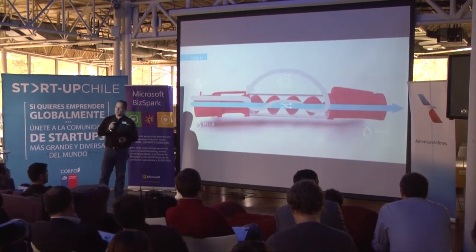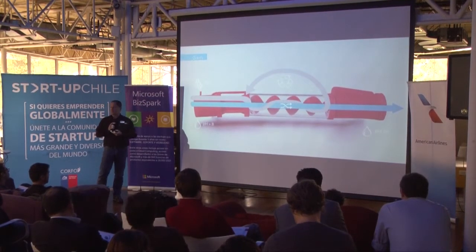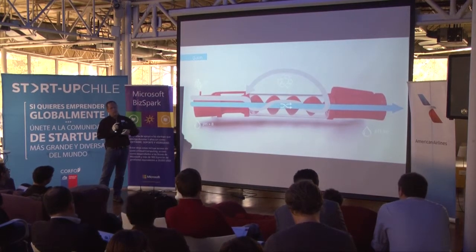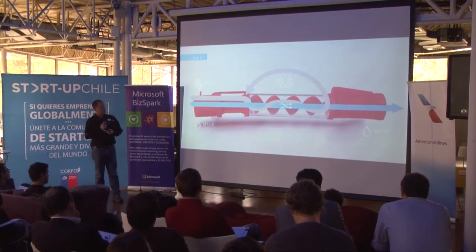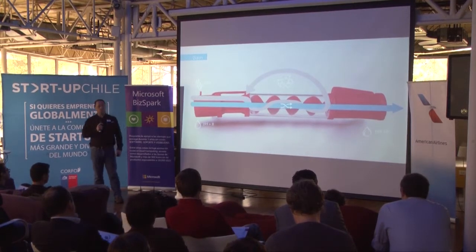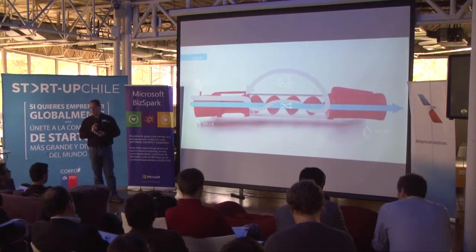In a few words, I'd like to show you how this system works. The blue line shows water flow into the system and the grey line shows carbon dioxide flow. We inject carbon dioxide on the first stage. We mix both gas and water in the second stage with the helix and the mixing chamber. And we recover the CO2 that didn't react on the third stage and return it to the first stage, making a loop of CO2.